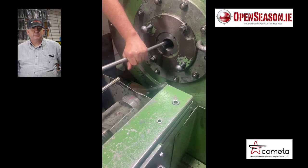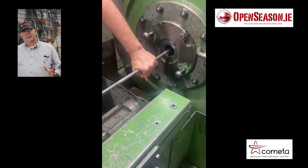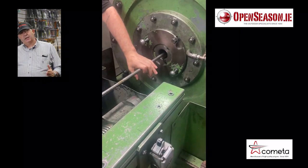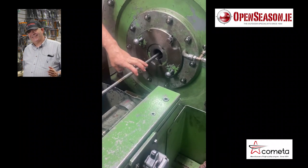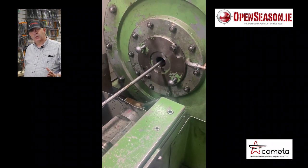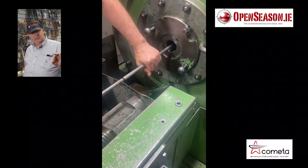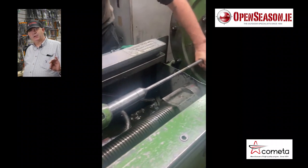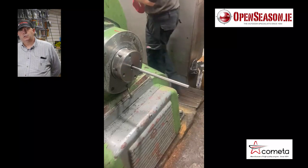So the next piece here is where we actually put a barrel on top of the die, and we insert the die and the barrel into the cold hammering machine. The barrel and the die come under immense pressure from the cold hammers, where they're beaten. Essentially, the barrel is beaten down onto the die on the inside, and we leave an imprint of the rifling on the inside of the barrel.